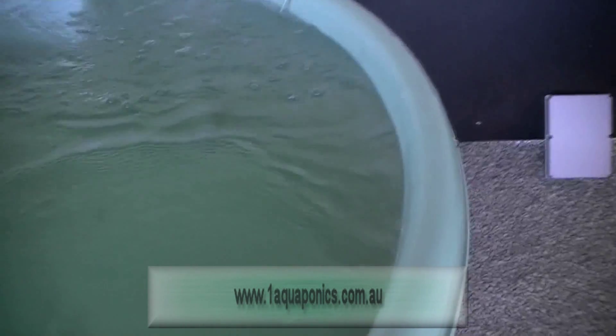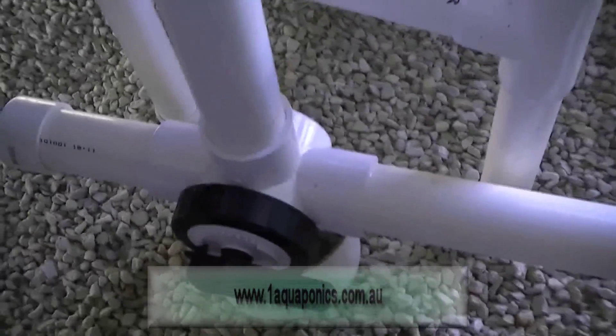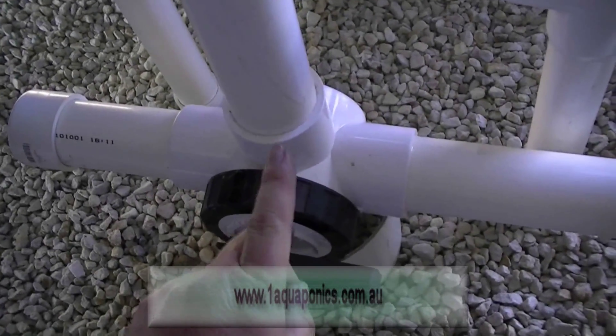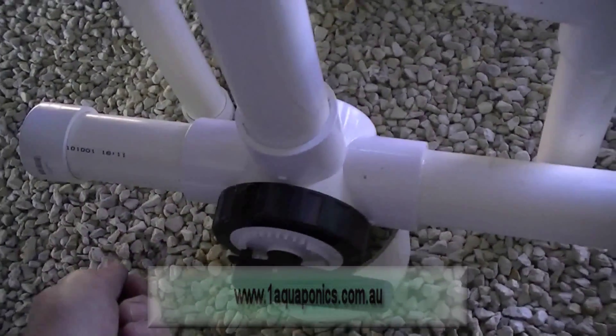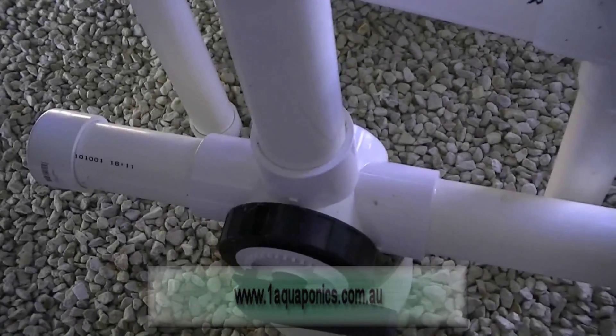Once the water flows out through that central drain system, we move through this pipework here. You can see down here we have a three-way valve, which is set at the moment at a 90-degree angle, so as the water travels in, it is now travelling up into the clarifier. To dump the 2000 litre tank, or to dump any wastes, one simply turns the valve — either clockwise to cut off the clarifier and drain the tank, or anti-clockwise to drain the clarifier but block the tank off.